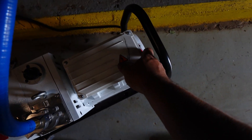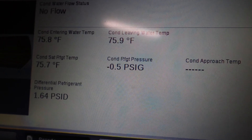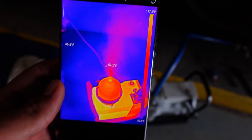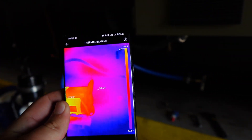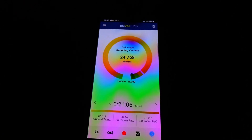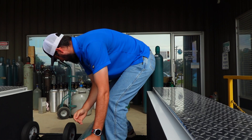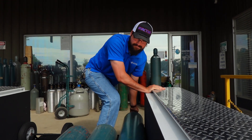The vacuum pulled really well at first and it was honestly starting to look a little too easy — the kind of easy that you just know isn't going to stay that way. We let this first vacuum pull overnight and came back the next morning to find it at 2,500 microns, which was unexpected because of how well it was pulling the day before. I genuinely thought we'd be significantly lower than that.